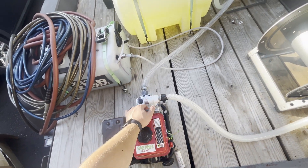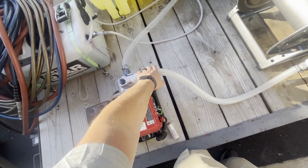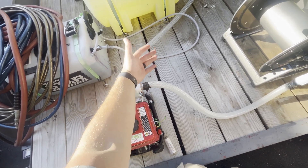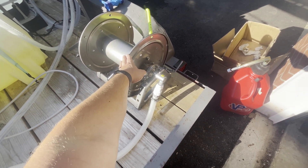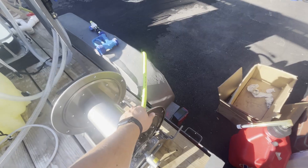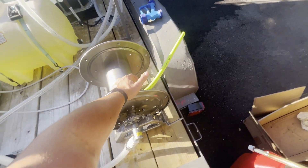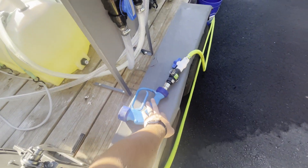I did a little bit of testing and found out that it's only making about 60 PSI of water pressure. But when you're pushing it through a half-inch hose reel using 5/8ths water hose at about 125 feet, I'm only getting about 9.5 gallons per minute coming through a blue washdown gun.